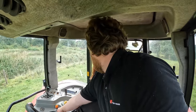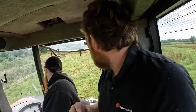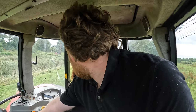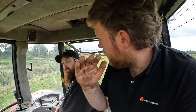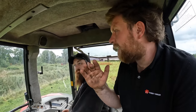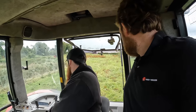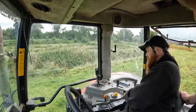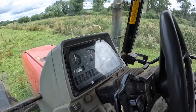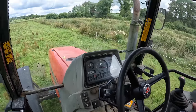just where she's catching. This chain is tightish. She runs on the roller and the lift rather than on the skids. On the skids, okay. So you just have her at the point where the chains are just kind of holding it. You'll know if you're too far when you're on that sweet spot. If she hits anything at all, you get the chuck of the chain. I'd say around that, so turn her on there. So then rev her up till she's doing about 900 RPM. Now drive her in there.